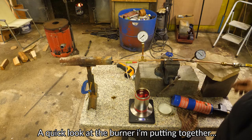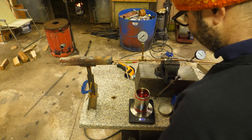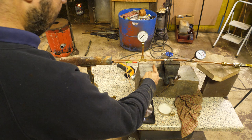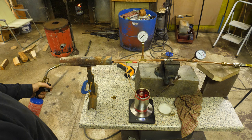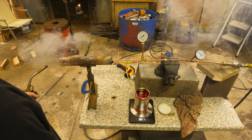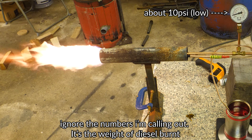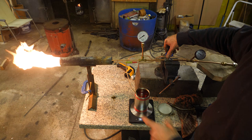The diesel's coming down the pipe. It'll take a little while to get there because there's an air bubble — it's quite a long pipe. Here we go. Let's get it warm first. As you can see: 24, 26, 28, 30. I'm going to put it right up now and see what happens to the flame. Once this is warmed up, hopefully it won't go out, but it could be quite cold at the moment. Putting it up to 30... 36, 38, 39 — and then it will go out.